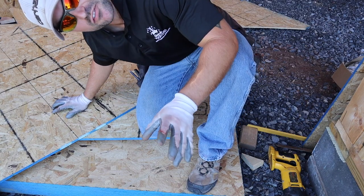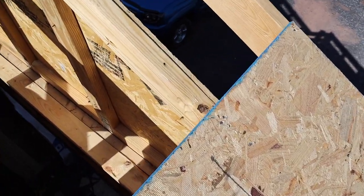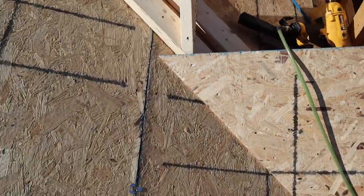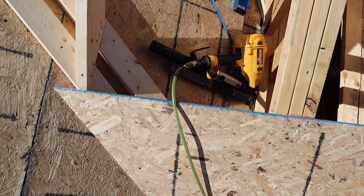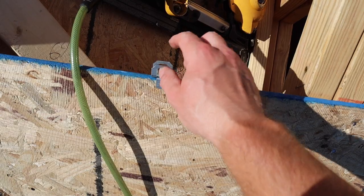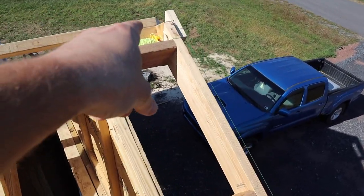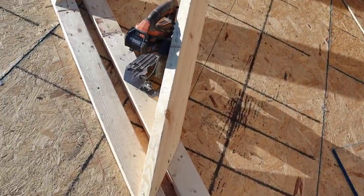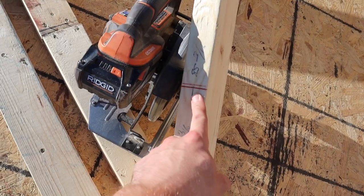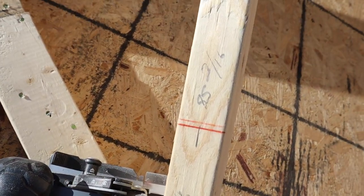Alright, let's go up on the roof and see if it works. Here's that piece put down — you can see we hit nicely on our chalk line and the crow's foot we made over there. Everything lined up really nice and tight in the valley right on the chalk line. Since our rafters are two feet apart we've got to use little clips that fit right here on the OSB — this creates an extra eighth inch gap. That's why we measure up 48 and one eighth, make a mark, hook your chalk line to that, pull it across, and chalk a line.